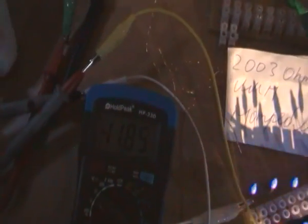So anyway, not charging here because I did not hook up my circuitry. You clearly see this 000, no current, no voltage getting to my battery, but the protection working, this bulbs working, and you see here clearly it's 11.86 volts which go through these lamps. But these lamps even show larger energy, but I cannot measure with my standard voltage meter.